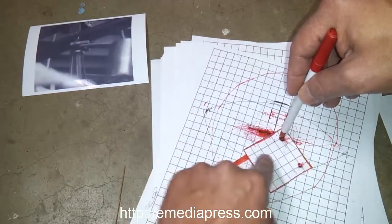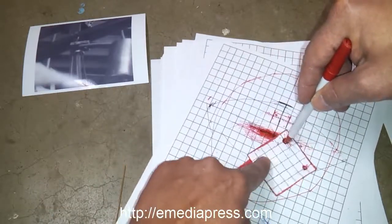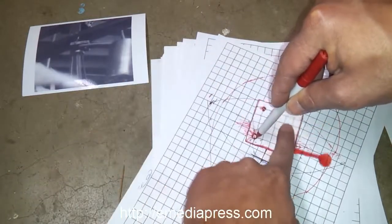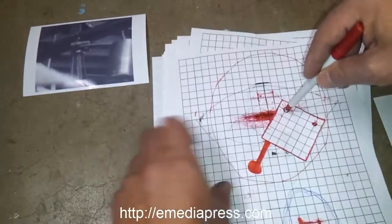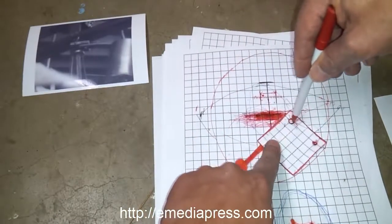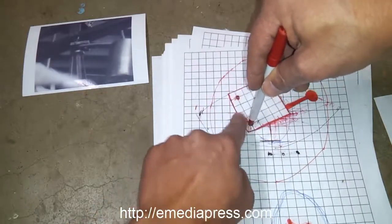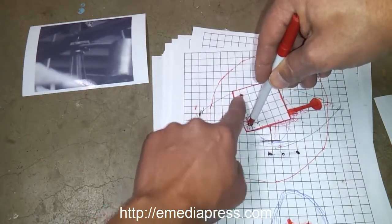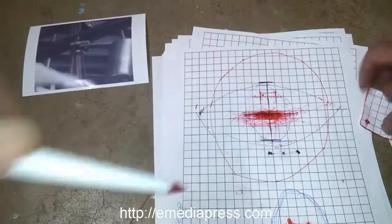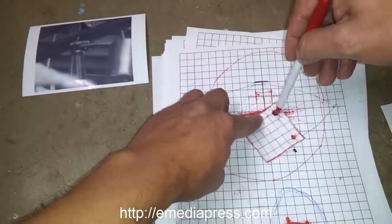So just follow with your eyes what that's doing. Sorry, I know this is not a Hollywood production by any means, but see, the center around which this is rotating is constantly changing. See, the center of rotation of the lower shaft connected to the lower weight is constantly moving. But anyway, that's the secret to the elliptical orbit and how this bracket makes that happen.